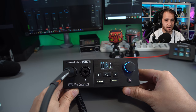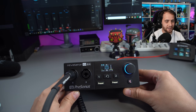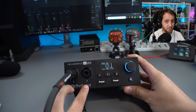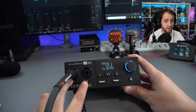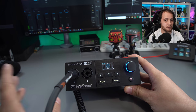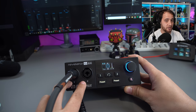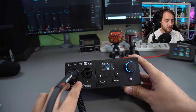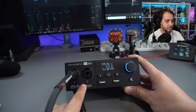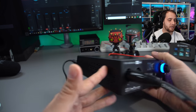Over to the actual audio interface. Like I said, I love the two XLR inputs. Will these 60dB gain XLR inputs power an SM7B without a Fethead? Yes they do. Of course there will be a little bit of hiss, and there's always an argument to use a Fethead or Cloudlifter, but these preamps have more than enough juice. I'm using the RE320 at the moment at about 45dB gain — sounds very nice indeed.